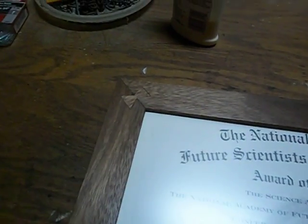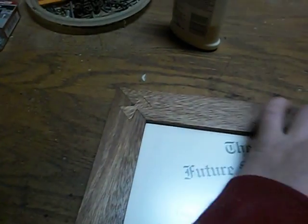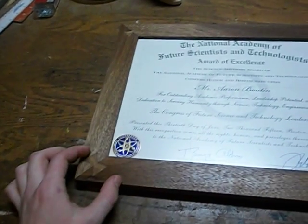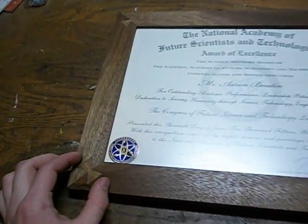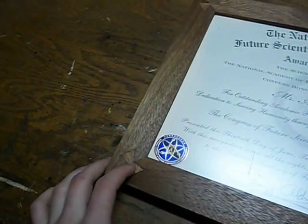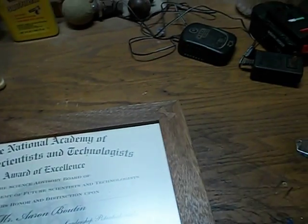I did this all out of mahogany because I didn't want to really be able to see these butterfly joints. You can see that they're visible just because of the contrasting grain — coming in, coming in, and going across — the contrasting grain makes it just visible enough that you notice it. But it's not like maple would be really stark against the mahogany. I was going for a more simple look, so I didn't use strongly contrasting wood.